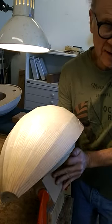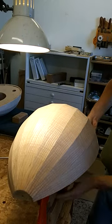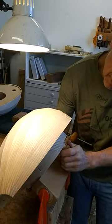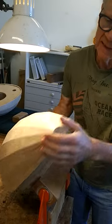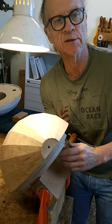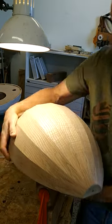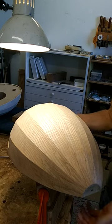It's a lot lighter to handle and it's easy to move around. Let me slip the back off a bit. So it moves side to side really easily, and there are a couple of knurled handles underneath here. If you back them off, then there's a turntable, sort of a Lazy Susan thing, where you can move it in that direction. Just tighten those knurled handles and lift it up, and you can scrape in any direction, any orientation.